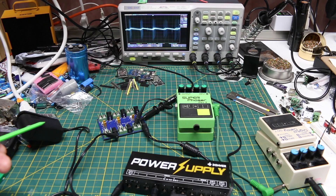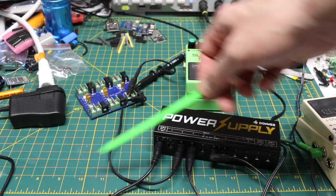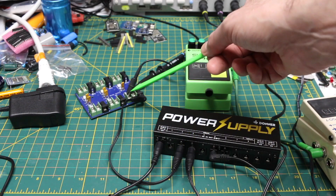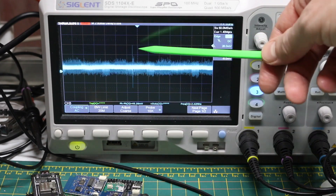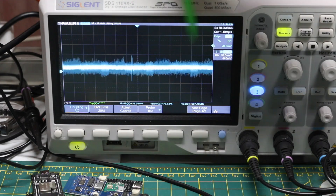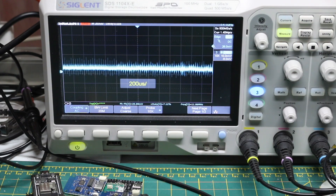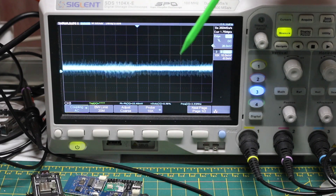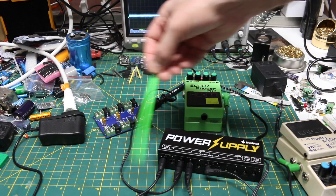Here's the cheap 18-volt wall adapter switching power supply that came with this guitar effect breakout power supply. Now it's plugged directly in to power this 9-volt adapter, with two pedals turned on as a load. I have one of the 9-volt outputs going to the scope probe. Changing the scale and pausing the screen, I'm getting little intermittent spikes up to 45 millivolts peak to peak. If I just let this run, it's got spikes all over the place — it's definitely not as consistent or clean looking as the other power supply. Whatever is going on here is causing interference and noise coupling into the guitar path.